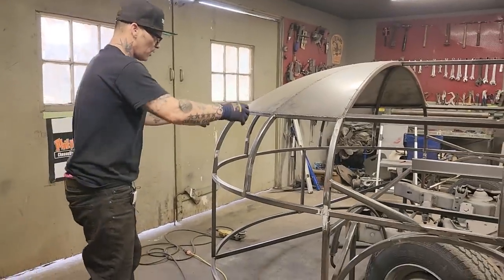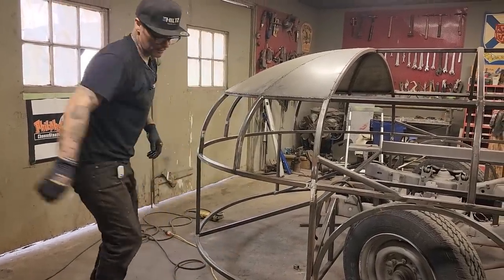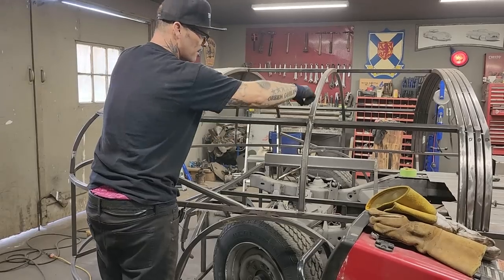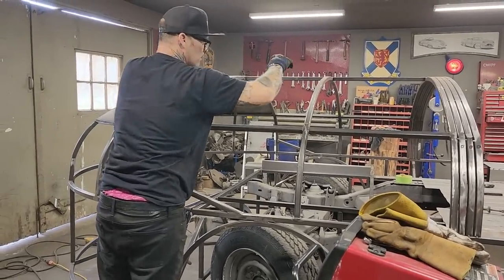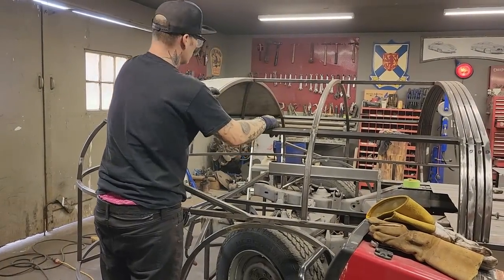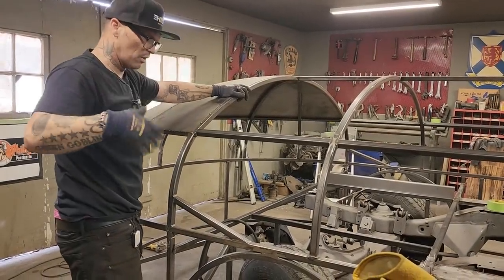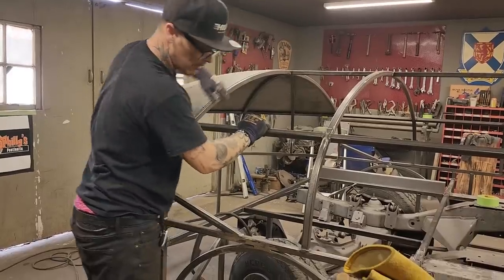Instead of making the door here, where I have to get down and try to get into it, what I'm gonna do is have a hatch door at the top. Probably just one. You could make two, you could put one on this side. And this is 3/4 inch square stock following this shape. Cut the metal that I put on top of here to the door itself. We have some actuators back here so it opens up. You could open up on both sides if you wanted to, but I'm thinking one should be fine, less work. So this will be a hatch door that comes up.